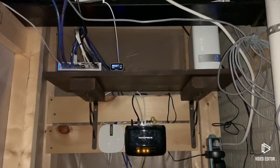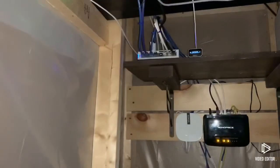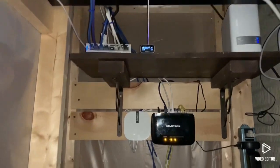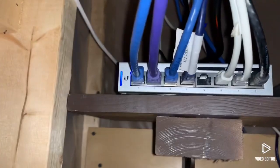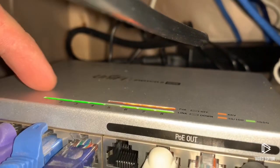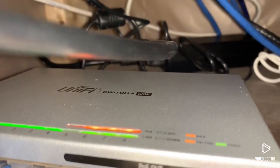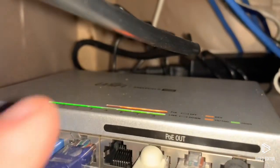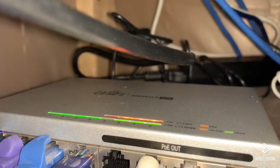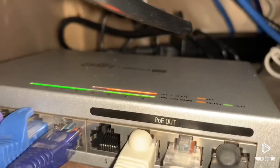Last part of the video — I had to run one more cable to a set-top box on the other side of this wall because it uses Ethernet, not Wi-Fi, since the Wi-Fi on the Fios router is disconnected. Here you go — got it all buttoned up. On top of the switch you can see activity lights for all eight ports: green means gigabit, orange would mean 10/100 megabit. On ports four through eight, an orange light on top indicates PoE is being injected.